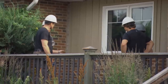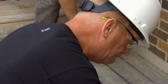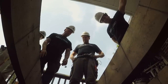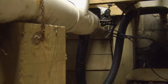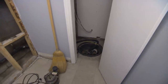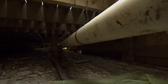This was the area that the water kept coming in. What I would like to do is pull all the boards up. We have a four-inch PVC pipe here. I see a flex line down there — it looks like they're running the sump to this line. The sump pump's job is to collect groundwater and water from the weeping tile, and it's installed in the basement floor. When the sump pump's full, it ejects it outside underneath the deck, so we want to make sure that connection underneath the deck is done properly.